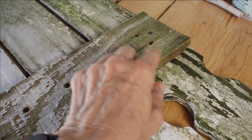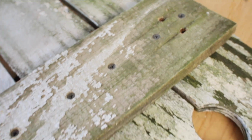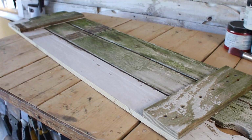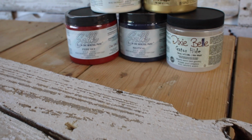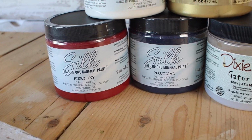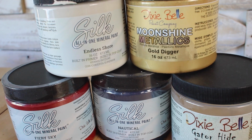The first step that you have to do is grab some reclaimed pickets. You can also use new pickets, but I happen to have some laying around. I cut them to length. Mine are cut to about 30 inches long. Then I used the scrapped end pieces and a screwdriver and a couple of wood screws, and I attached them so that the three pieces would stay together.